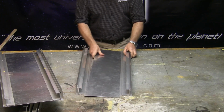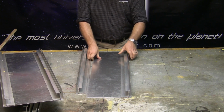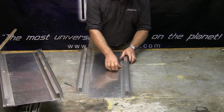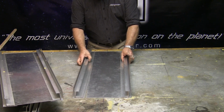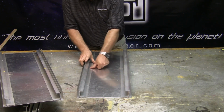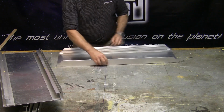After we get done placing the sheet metal on the perimeter of the sign, and it's aligned, one of the things I state in the literature is that there's no squaring involved. When the sheet metal's cut square, it all falls into place. And if you have a decent chop saw or a decent cutoff saw, and it's set properly, you cut your 45, it'll come out right.